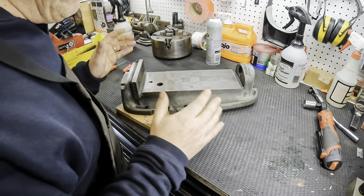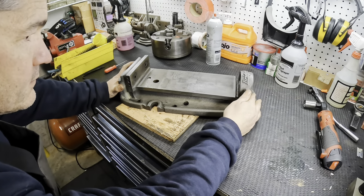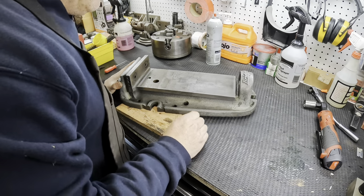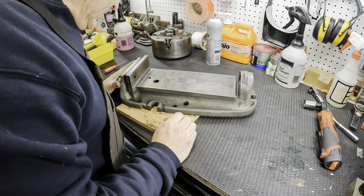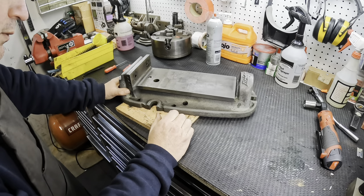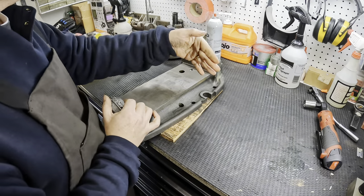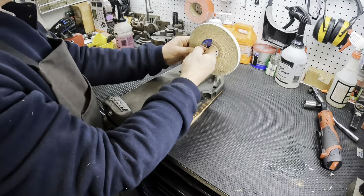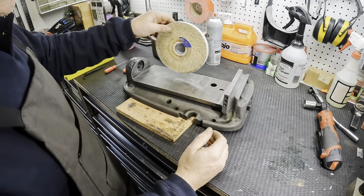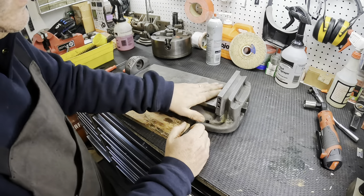With the bed here cleaned up - as in no more grease on it - I'm trying to think about what I want to do, how I want to bring this thing back to life. It doesn't seem to be particularly worn. Quite honestly, now that I'm thinking this through, there's not much I can do about this bed. My surface grinder will not be able to do anything on this because I can't slide it that way - my depth is only about eight inches. So surface grinder is out of the question.